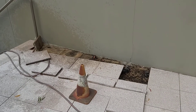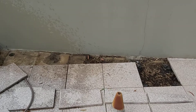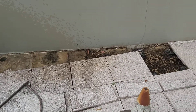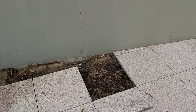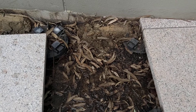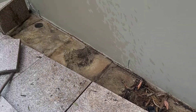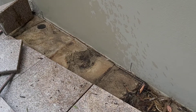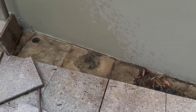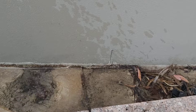Unit 21 Korea Street: the pavers to the upper level are not sitting on stands against the wall — they're sitting on sand and cement screed, which is trapping and pooling moisture and water against the wall below the cavity flashing.